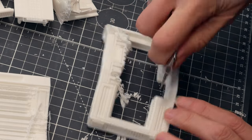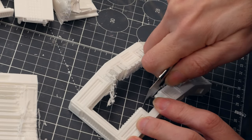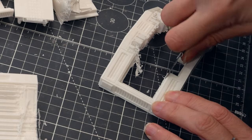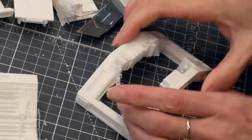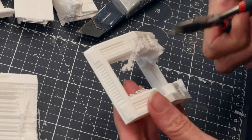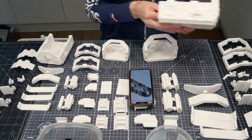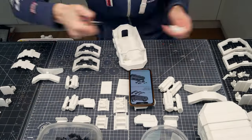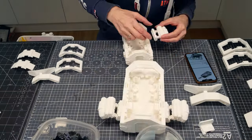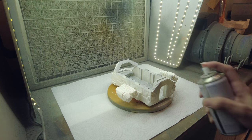You can help yourself by where you place supports in your slicer. I use PrusaSlicer and I can paint on where I don't want supports or where I do. I would never support an area that could be bridged — just the print head extruding straight over the gap without sagging. I only use supports on big gaps where you literally could not print in mid-air. With the supports done, I put everything together — it literally just clips — and sprayed it as a complete piece. I'm going to use the roof to mask where I need to do inside and outside, starting with Tamiya Fine Grey on the interior.